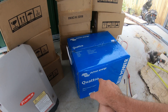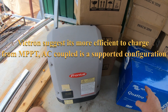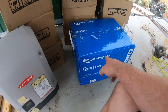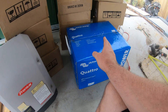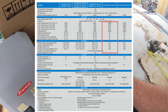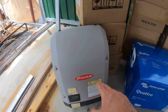The problem with that is the out-of-band PV inverter will not be available when the grid goes down — this one will. The benefit of AC coupling, as I see it — and Victron doesn't recommend it, they recommend only charging from the MPPTs — is that if it's producing 3 kilowatts and you have a 6 kilowatt load, 3 kilowatts comes from this and 3 kilowatts comes from this. If you don't have one of these and you're going DC only, all 6 kilowatts needs to come from the inverter. This one's 8 kilowatts constant load, 20 kilowatt peak, so it's huge really. But I still feel like keeping the temp down on this so that it can handle the peak loads and let the AC-coupled unit do all the heavy lifting during the day.